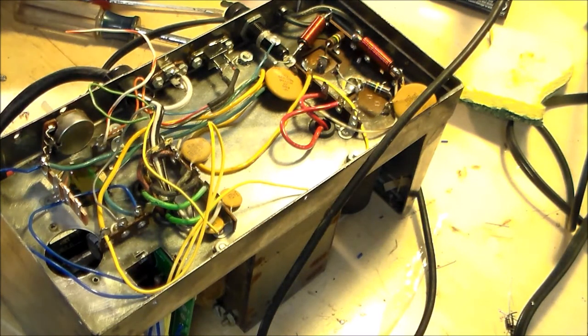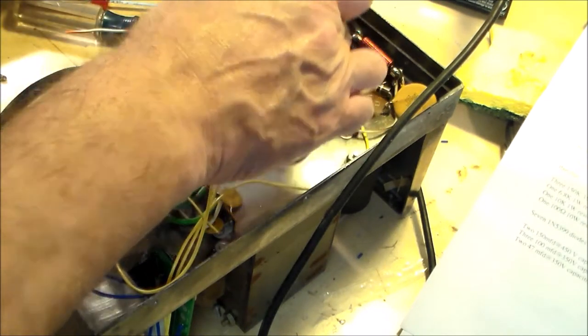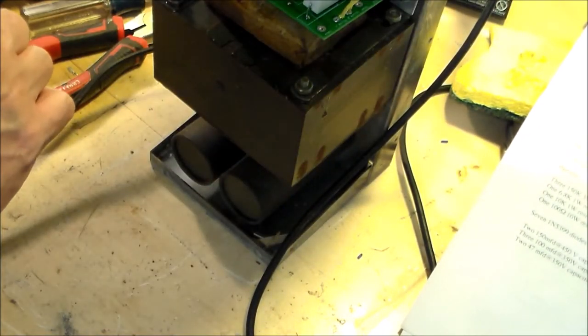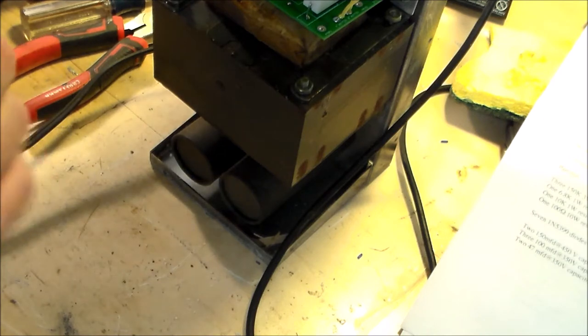So where are we again? This is your blue wire, this is a blue wire, and then you should have both large. Now run a red wire from either red wire, so which one doesn't matter. Okay, two large, single. Okay, run that wire to the pad on the PCB labeled red. So I'm going to do the PCB side first and cut this wire to size. First, it says red. Is it red A or red? PCB labeled red.